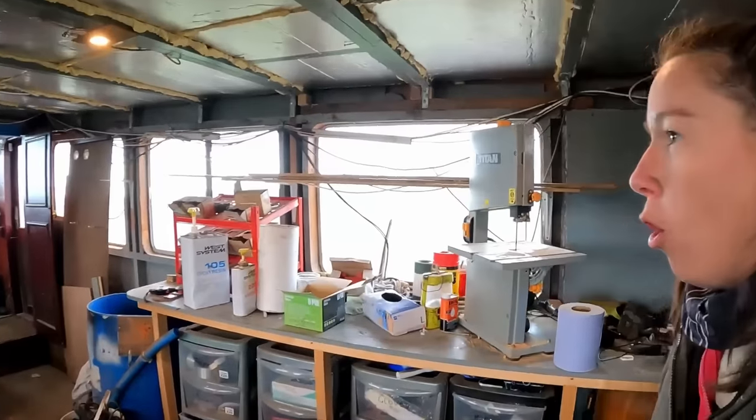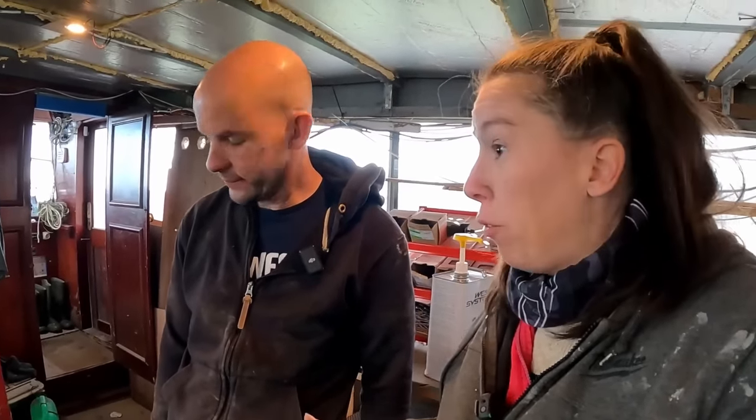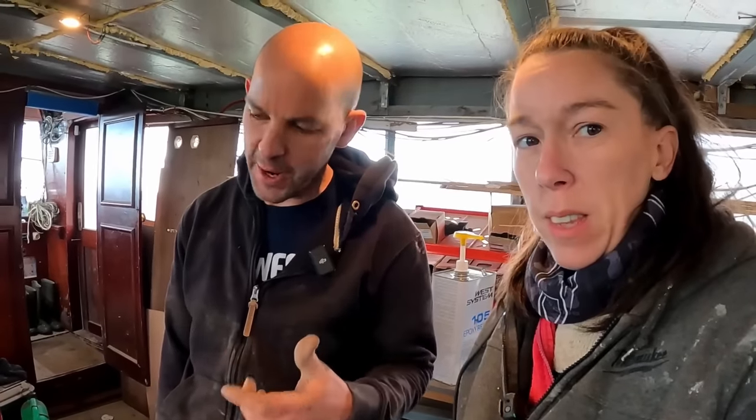Which is good, okay. But the issue we've got now for painting is we've got the big extractor fan that has arrived and is ready to keep us fume free. So that's quite a powerful fan. And the compressor draws in excess of 3,000 watts on startup. Our inverter is good for 3,000 watts, plus a bit, so we're having to turn all of the AC off, fire up the compressor. When the compressor's running, it only draws like 1,500 watts. So yeah, we're going to be doing some juggling. I think if we can keep the compressor going...